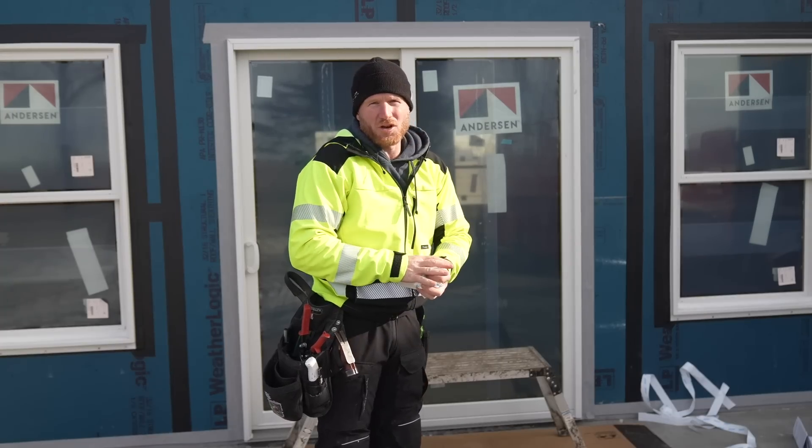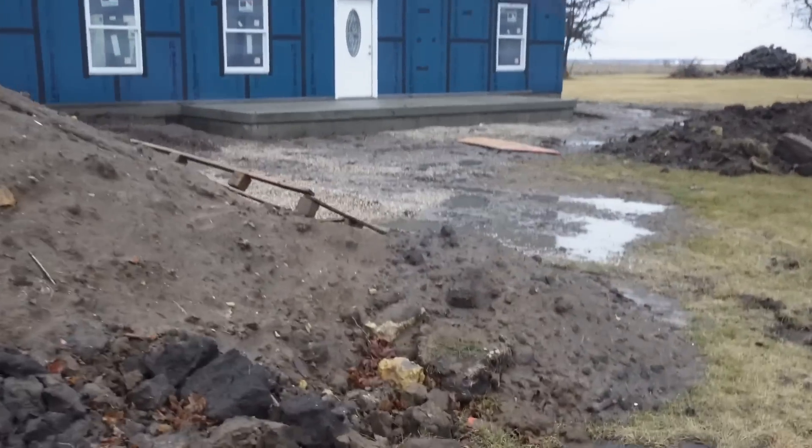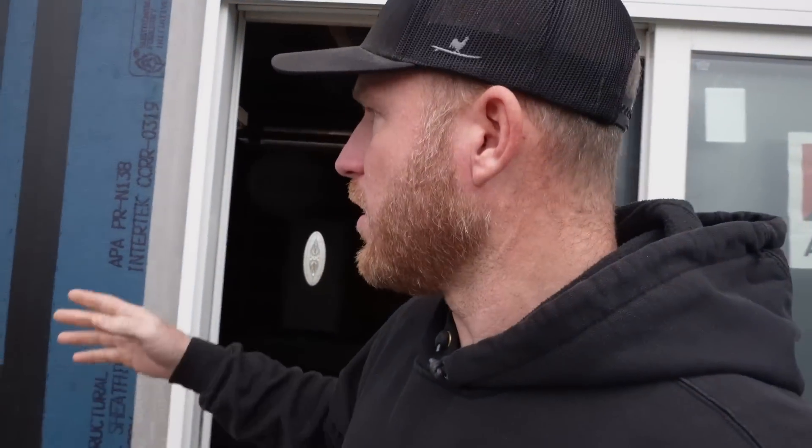Door is done, and we want to keep snow and weather out as much as possible. It is extremely windy and muddy out - we've gotten about a half inch of rain overnight and site conditions are not the best. But now that we have all the sheathing on, roof on, and windows and doors installed, we're going to come inside. Much better in here. We're going to work from inside to get all the measurements on the windows and doors, then go back to my shop where it's dry and warm. We're going to pre-assemble all of our windows because we're using smart side trims. All I need is the outside dimensions of the frame, then I can calculate all the cuts from the shop, assemble them, glue them, pocket hole screw them, bring them back, and just set them in equally spaced and fasten them.